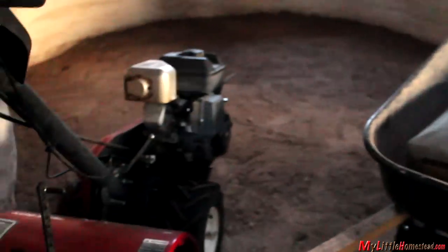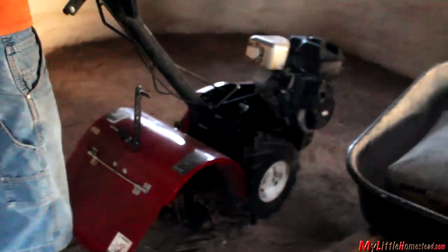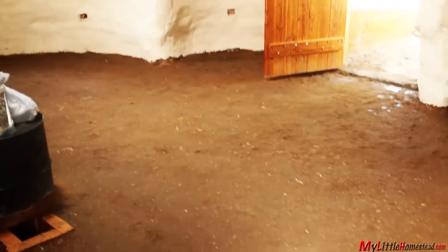We pour cement on top of the soil, estimating a nine-to-one ratio. When preparing the soil cement floor we needed a rototiller, which we didn't have. We made a deal with a local family whose rototiller wasn't working — Garen and Bryson are very good at fixing small engines, so in exchange we got to use it. That worked out great, so we thank you Kim and Jeff. Then level it, wet it, tamp it, and let it dry for a few days.